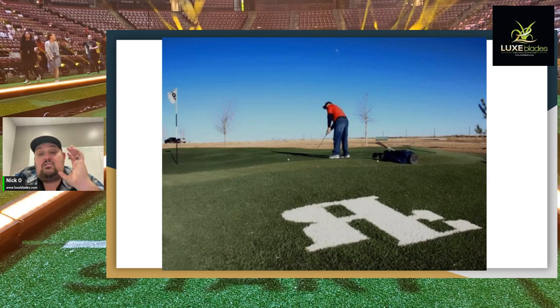So, guys, just remember attention to detail for everything. Have a plan in your head how it's going to be mapped out beforehand. And whenever you're doing base work, always add, let's just say, like a little putting green, say a 500 square foot putting green, add an extra load of base in there just in case. Just in your bid, add it in there. You may not need it. That's great. But if you do need it, it's accounted for.